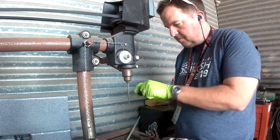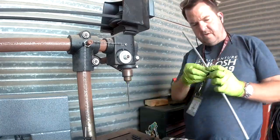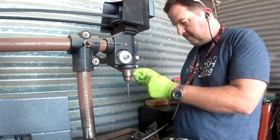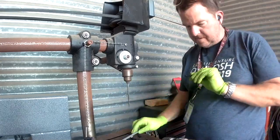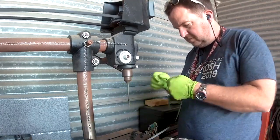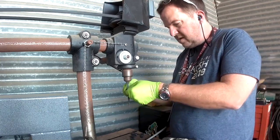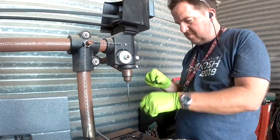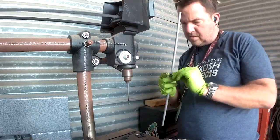Here I've got the file back in the drill press and I'm working on the front half of the composite line holders. I've got a piece of spare line that I'm using to test — each time one goes in, I make sure it fits all the way back, because these have to slip on a fair amount. I'd hate to start putting these things on and find out I didn't drill enough of a channel and the holes don't line up. So we aren't having that.